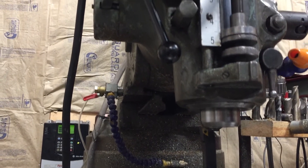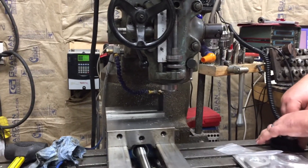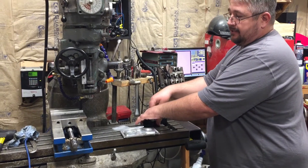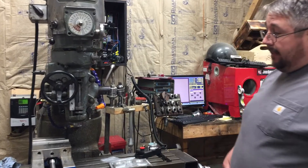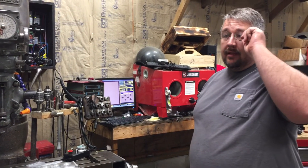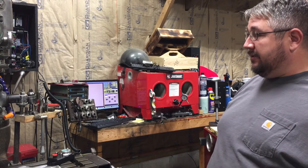We did machine the bottom of the spindle. I wasn't sure if it'd be too hard, but it seemed to work okay. That's just a Shars brand half-inch tooling that I got from my little lathe, and I thought that'd be the squarest and easiest way to make the mill flat on the bottom - rather than trying to stone it or just get the little burrs off.